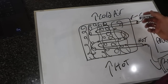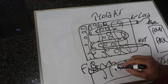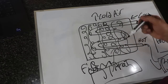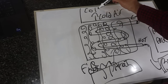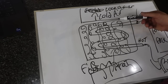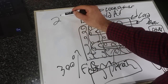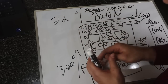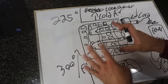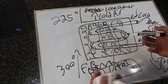So I thought in theory I could install this into my smoker. The firebox with its burning fire pushes hot air through the radiator with cold water flowing through it. The air gets exchanged and then what I get in the cook chamber is cooler air — so if I'm getting 300 degrees going into the radiator, maybe I'm getting 225 on the other end, which is exactly what I want. But the big question is: would all of this work and allow me to get the low temperatures I want with a hot burning fire in the firebox, or is it just a poorly drawn plan on a whiteboard?